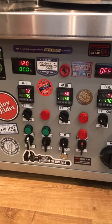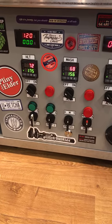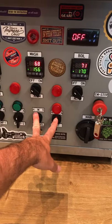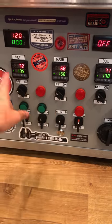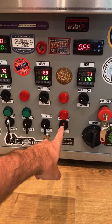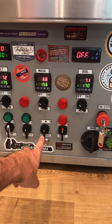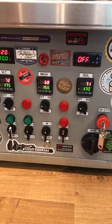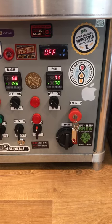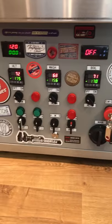We usually set it about 85% — that would be dependent on your system. At the bottom we have two switches for pumps. They're set up to have automation but right now we just use them in manual mode. There's also the controller for PID control, selecting which controller has control of the system — hot liquor tank, mash, or boil. There's a switch for whether the controllers can actually fire the coils, so we can set this up, do tests, run the controllers, and as long as this switch is off the coils won't fire. I also have an on-off switch and an emergency stop — a dead man switch. We have three little kids running around here, so if they were to open the panel, nothing inside the panel would be powered anymore.